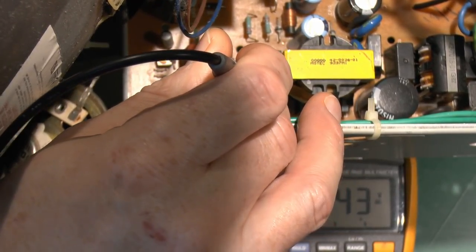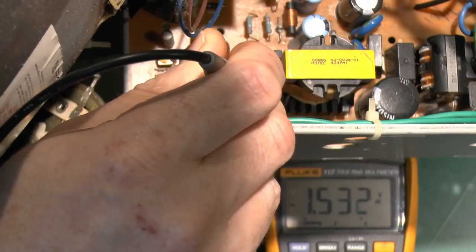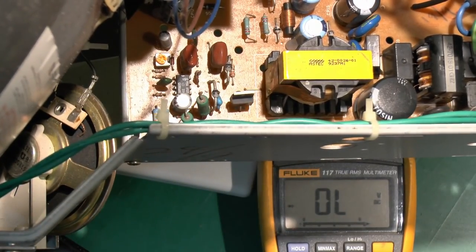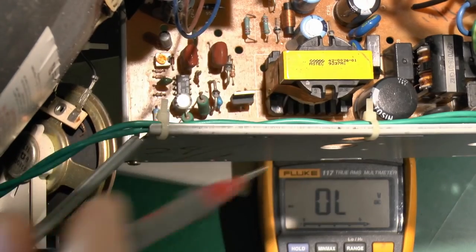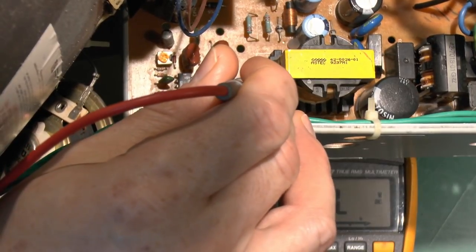And if we go to the side pin, we're getting a voltage drop of about 0.5, so that would seem reasonable. And if we go to the other pin there, we're getting about 1.5 or 1.6 volts. So again, that doesn't seem too out of the ordinary. I don't actually know what this is. I can't read the number because the side of the case is in the way. But nevertheless, that's not unexpected. And if we check it in the other direction,